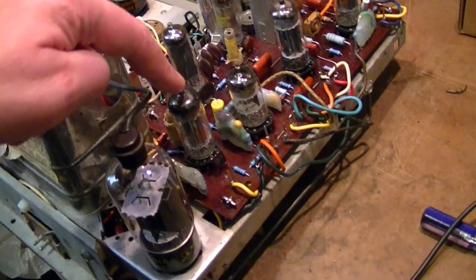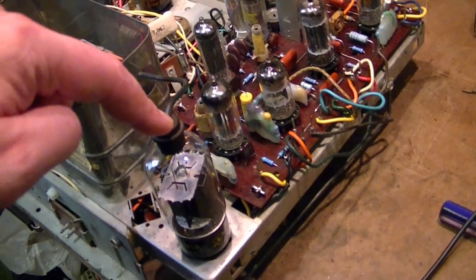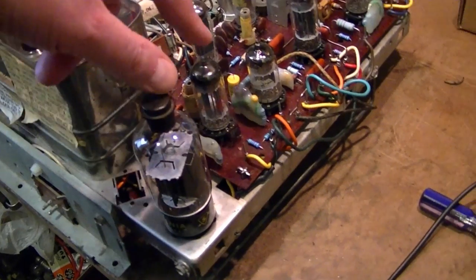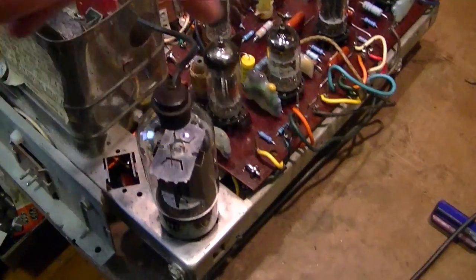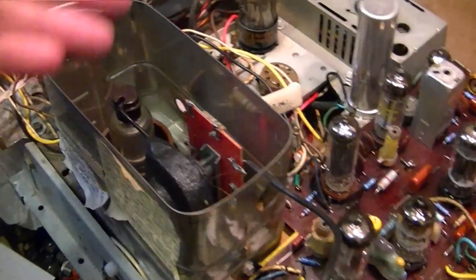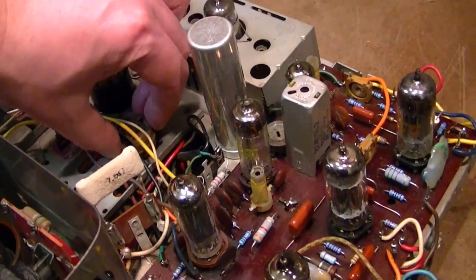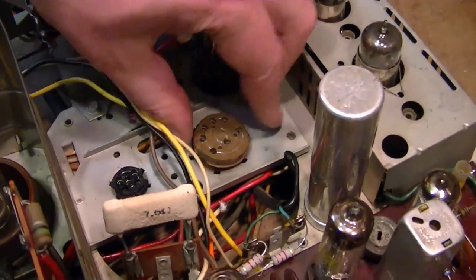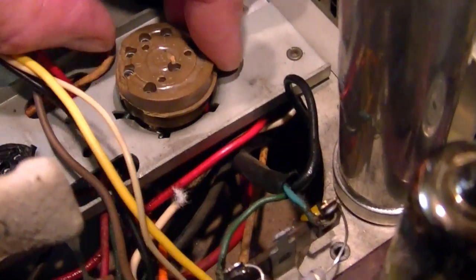Here's the horizontal oscillator and output tube. Both of these are likely culprits if it's a loose tube connection, or the components around there if it's something bad on the circuit board. Also could be a problem with the flyback or an issue with the yoke connection. And here's one of the sockets here — there are two plugs here and here. This one is broken off. That's how it arrived to me. There's a chip in the Bakelite material — a chunk broken off here.